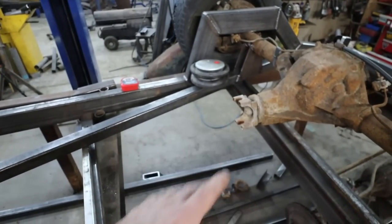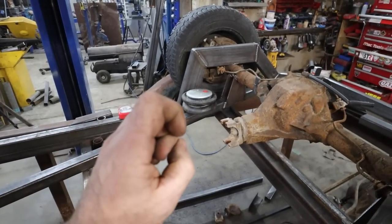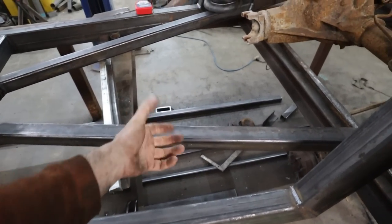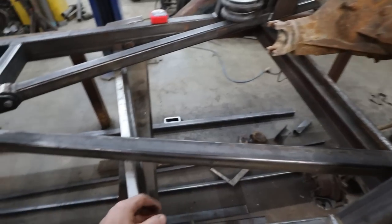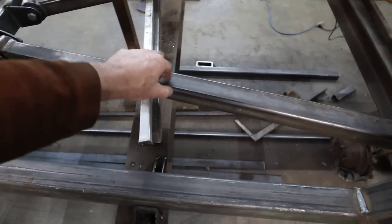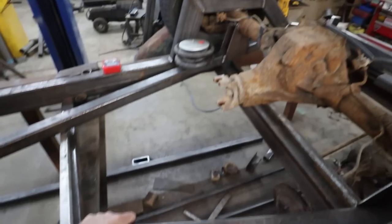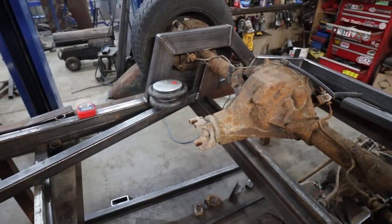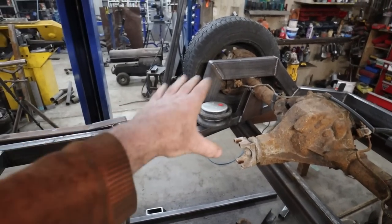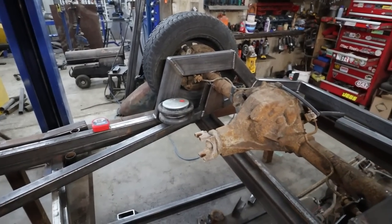We're going to burn a plate underneath it. Drill the hole. I want to weld a slug in there so we can sandwich that up and not worry about this pipe filling with junk or collapsing, like we can squish it. Not that we can. I'm pretty sure I did these with 1/4 inch, so these are overbuilt for what we're doing, but hey, it'll be good. All right. Anyways, let's cut and start this, and then we'll start scabbing things together till I feel that bag mount is super strong.